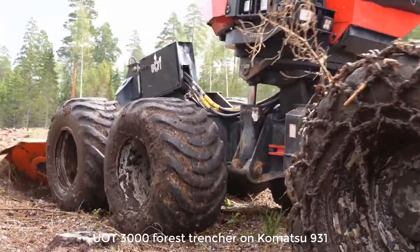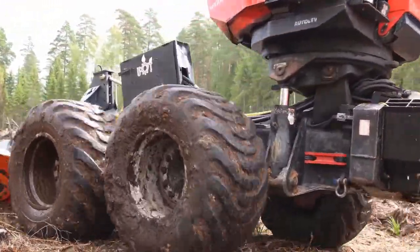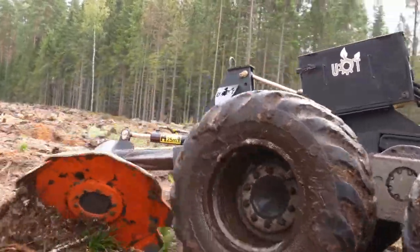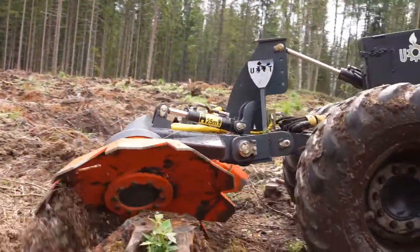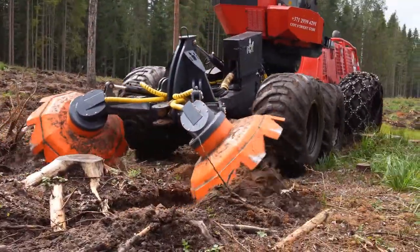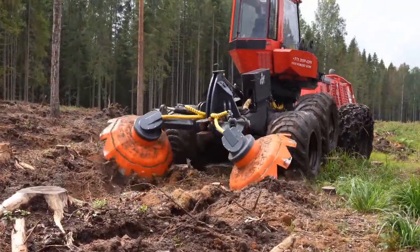Suitable site conditions. Sites that have medium moisture content are best for the disc trencher. It should not be used on sites that are wet. Disc trenchers can be pulled through light and medium slash. Heavy slash will greatly reduce disc trencher effectiveness.